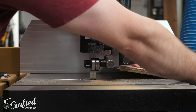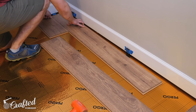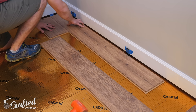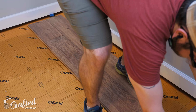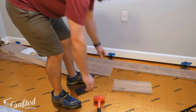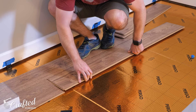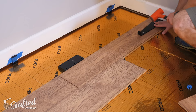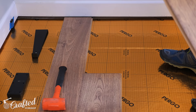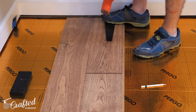With my corrected boards I could get to assembling the first few rows. To attach the boards I first lifted the board with the tongue facing the groove and pushed it in until it was fully seated, then pushed it down to lock the boards in place. I added the next board, seating that long edge first, then tapping the board into place to seat the short edge. With a few boards added I could put a box of flooring on top to help keep them in place while tapping. I found it a lot easier to put these together by staggering the boards rather than trying to do one complete row at a time, at least for this first pair of rows. Once I got to the last board in the first row I needed to use a pull bar to pull it into place since a tapping block wouldn't fit. To mark the last board on the second row to length, I just flipped the board around so the grooves were facing each other — this ensures a perfect length with no measuring.